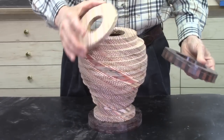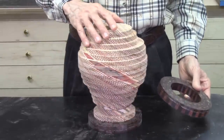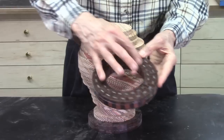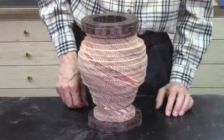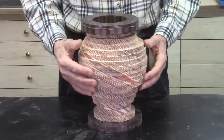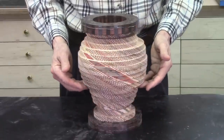All of our laminated discs have been glued up into sets of 5 discs and rotated at the appropriate angle. I have a total of 18 of these 5-layer discs, and some of the discs at the bottom actually contain 6 layers, so I have a total of 96 layers of laminated discs in this bowl. Plus I also have a top and bottom ring made from some segmented catalpa wood — 24 segments in this disc — and it may actually create a feature strip when I get closer to finishing it. I took each of these discs, and after they came out of the gluing jig, I sanded the edges lightly to get rid of excess glue so I could more easily see the edges to accurately align this when doing it on the lathe. For details on finishing this dizzy bowl project, see my YouTube videos on producing the large dizzy vase as well as the other dizzy bowl project videos.